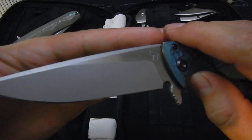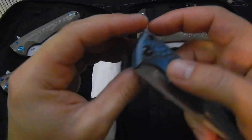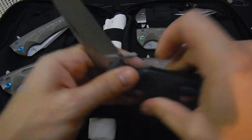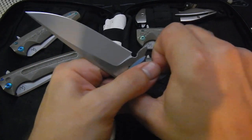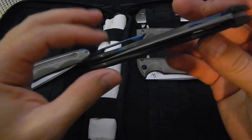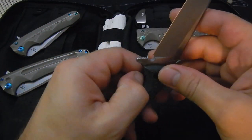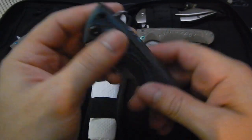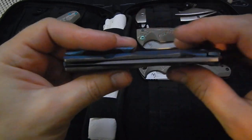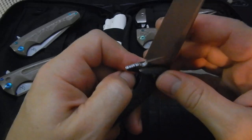One of the reasons it's so incredibly smooth is probably because I went back and did the two-tone finish — polishing up on the fine belt on the flats — which always makes the knife a lot smoother. It's just tricky; I'm always scared to do that. But it came out pretty cool. Once I fix it, it's gonna be a really cool, really good knife. It was a real bummer seeing how well it works and then finding out the lock is just a little off. Over the course of the build I set the lock at the beginning, and as you work with it, it settles in — you flip it hundreds of times. Most of the time it settles in nicely, but this one wasn't settling correctly. It's just not enough radius; it's too straight there.